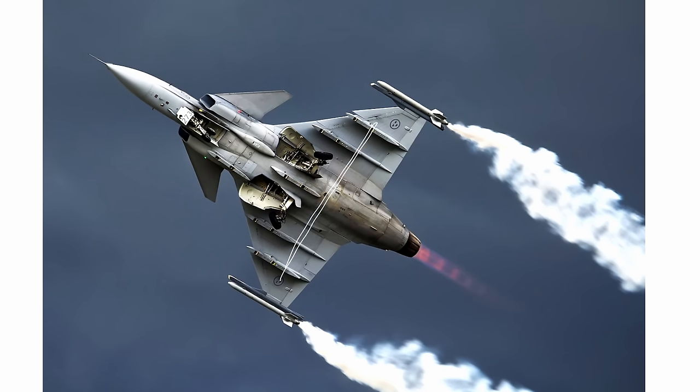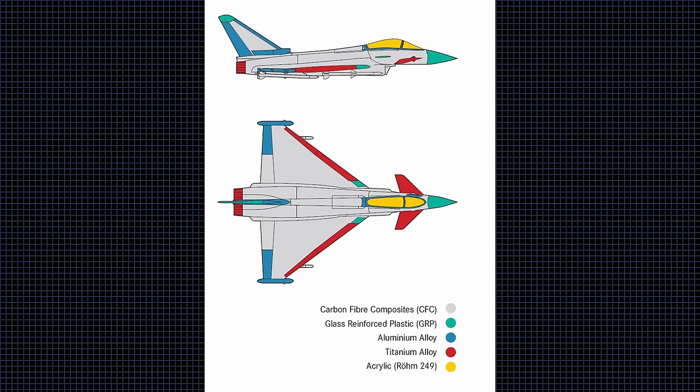Usually the spars will be perpendicular to the aircraft axis, and the main spars will join through the fuselage, making the wings a single structure. The paneling is mostly carbon reinforced plastic, and the moving surfaces are built with an internal honeycomb structure. The fuselage is more traditional, with bulkheads and longerons, but with little use of stringers — and this again is a testament to the stiffness of the structural design.